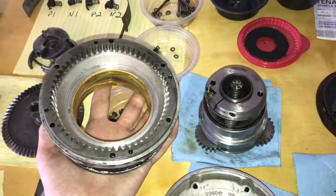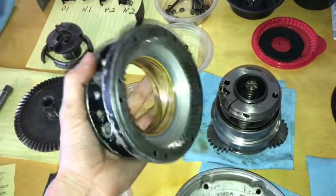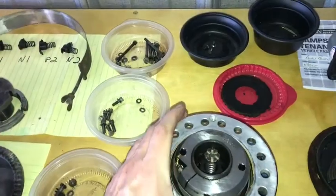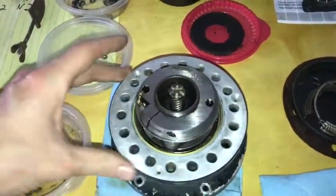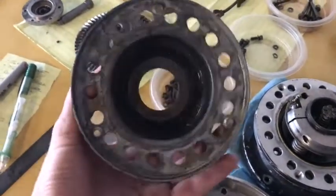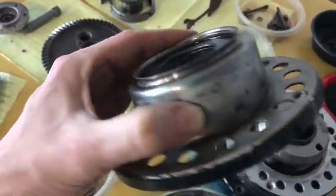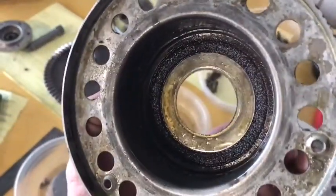The planetary gears are held inside of this housing extension. You can see there's a brass insert with the outer planetary gear — it goes around the outside and engages them with the planetary gears. This cover contains a leather seal with a washer on the back. It's very important that you do not attempt to remove that leather seal. It's pressed fit in there, with these little pin holes that hold a retainer in the back.